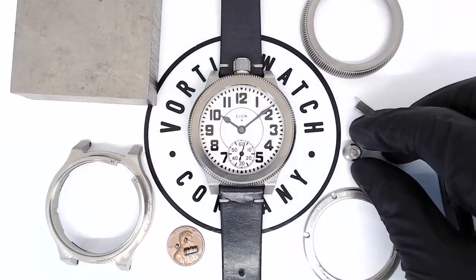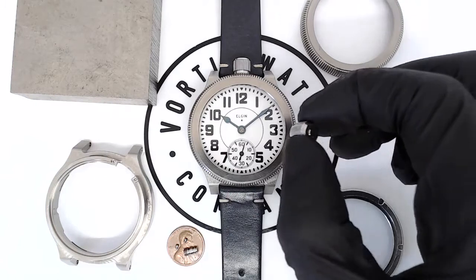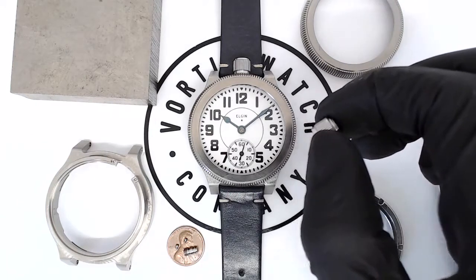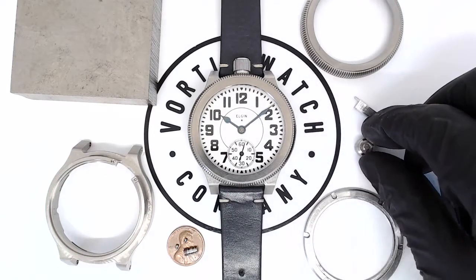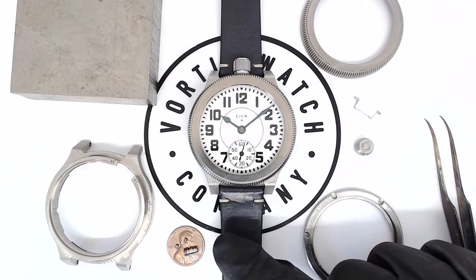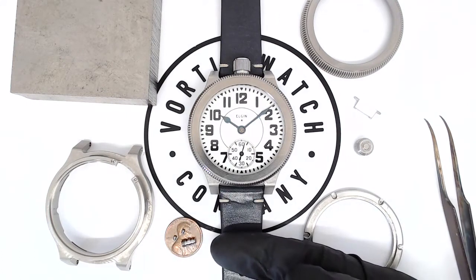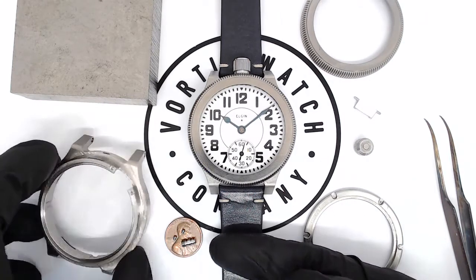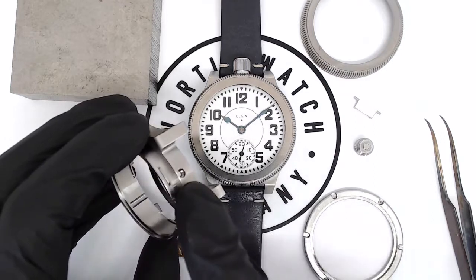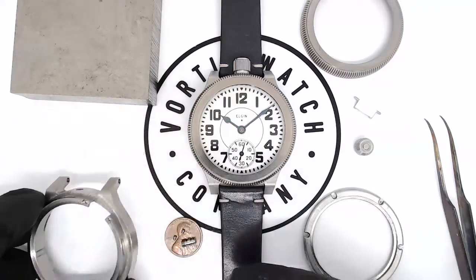And then obviously we have the crown. This crown is also made here in our shop on our CNC mill, and that one is also stainless steel. And then we have these pieces sitting on the penny — this is the pendant that the crown functions on. As you turn the crown, it turns around that cylinder, and that cylinder is screwed into this hole on the case. We custom make that for every watch as they need to be slightly adjusted.